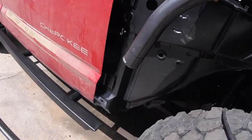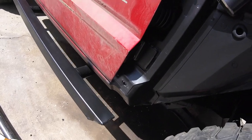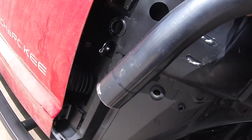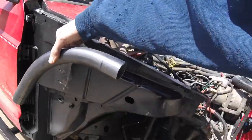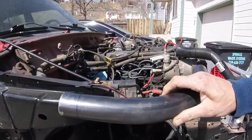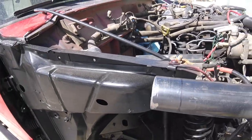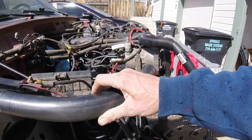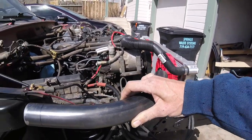So from there, I can measure from there to there to give me the amount of tube I need outside the die. Then 13 inches of tube will give me to there. And then from that line to the start of the next bend, I can know how much tube I'll need there. And then measure off 30 degrees to go out to where I want.